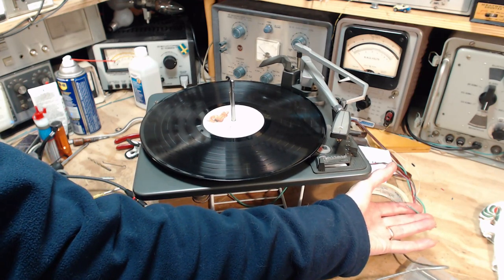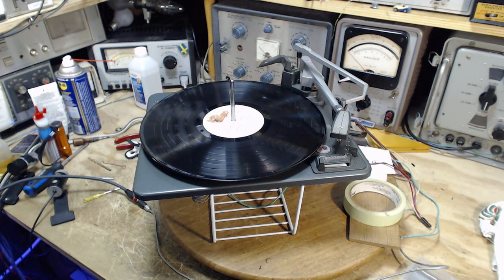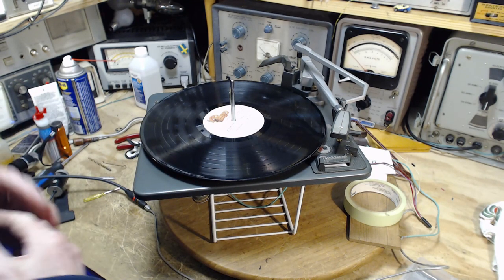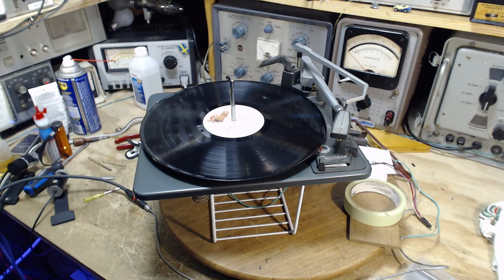That must be developing static charges every time I move around, because every time I touch this you hear a click, click, click. A little static voltage is building up. Not surprising, the humidity in my house, like any Canadian house, is extremely low. If we take no action in this house to push up the humidity, it will fall to 15%. At 15%, you're having nosebleeds, furniture is cracking, walls are separating, everything is shrinking. So by use of humidifiers I'm able to hold it around 21-22%. That's the best I can do. Apparently, comfort is 30-50% humidity. Well, no, we never get there. So lots of static charges all the time.